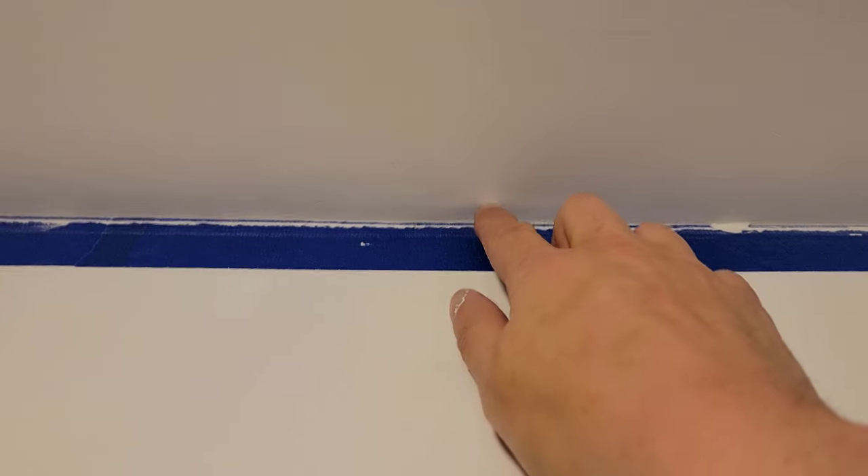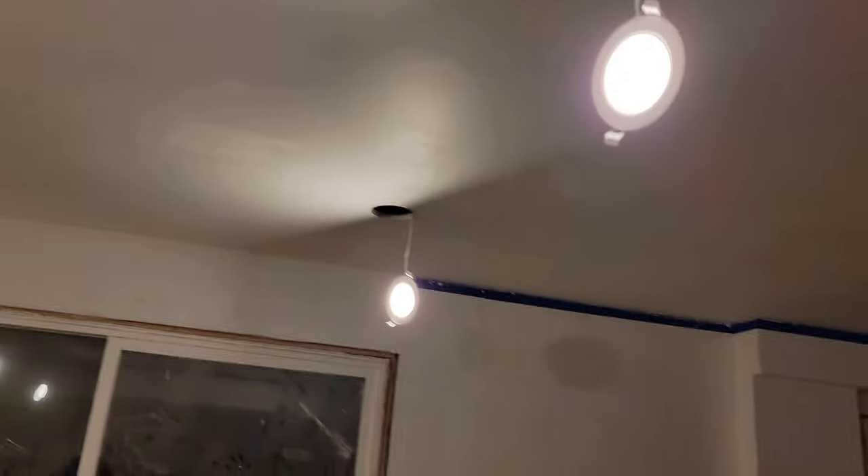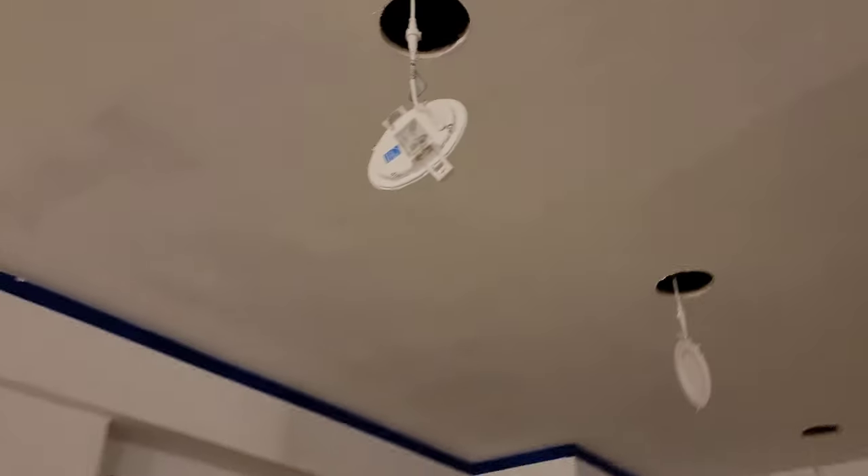What I couldn't see until I looked at this under daylight is that there are a couple of faults. This is a bubble underneath the tape. Probably what I'll do is slice that open and either put some glue in there or a little bit of mud and just slap it back up. I don't want to waste a whole lot of time. That's terrible — okay, that's worth fixing.